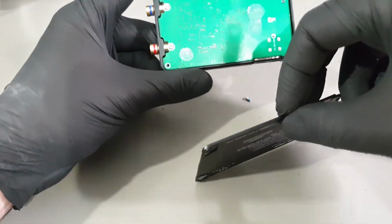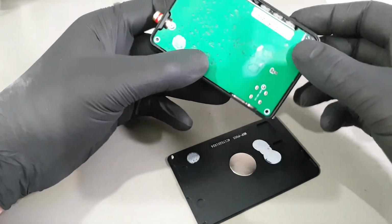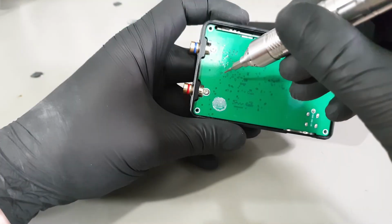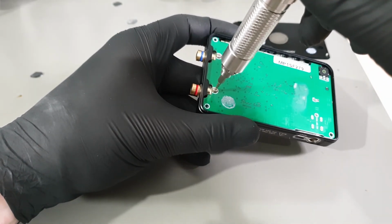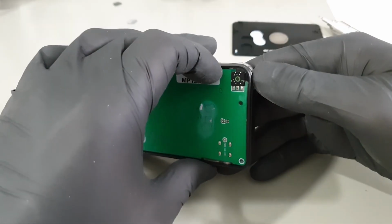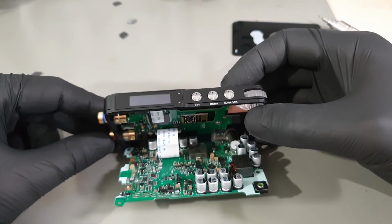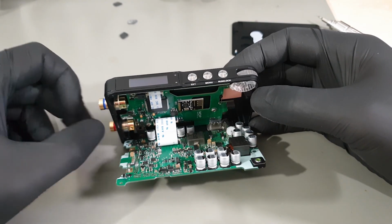Underneath the lid there's a big magnet that holds the stack together loosely, and a few dabs of thermal compound. The heat-sinking vias are covered by solder mask, and the lid is covered by anodizing, so no isolation necessary apparently. The banana receptacles are these gold-plated chunks that are just screwed down to the board, making the teardown experience as pleasant as always. Oh wow. Very high complexity on very little space. Pretty much what I expected from the performance that we were seeing.